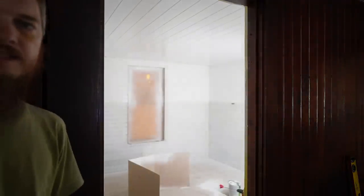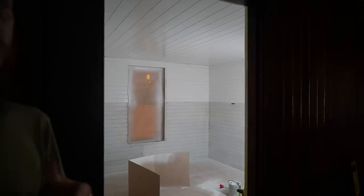So I'm going to give you guys a sneak peek of the bedroom to see how it's coming out. You can see the white paint is all finished on the ceiling and walls and it looks really good. You do see like over here a little problem spot. What happened was when we were peeling the paper off, the tape did pull some of the primer off. That worries me because it means that our primer isn't getting a good grab, but it's not the primer's fault. It's actually the old wood finish. When it came off, the primer took with it the old clear finish that was on the wood.